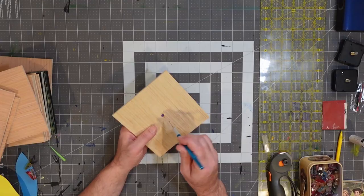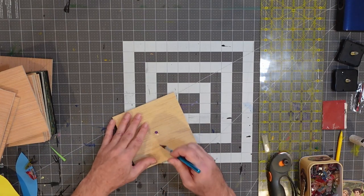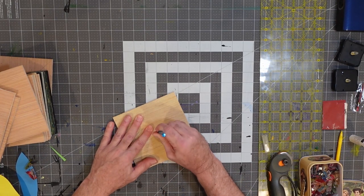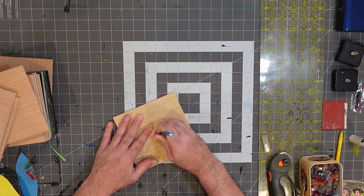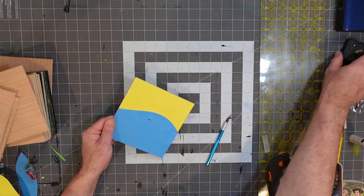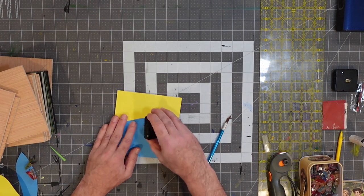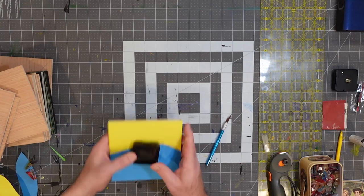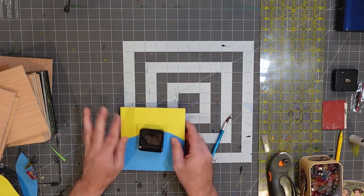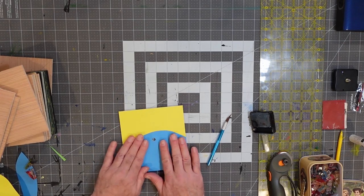One of the things I want to do before we go too much further is use my utility knife to make sure I've marked out where this hole is. I'm going to kind of poke it through here and try to cut it out a little bit. We're going to be pushing the spindle through here, so it doesn't have to be an exact cut. Once again, if I push my spindle through — I'm going to push it down through since the glue is still setting — yes, it will fit. That's the good news. We have our hole there to work with.